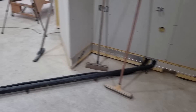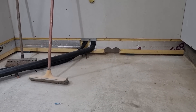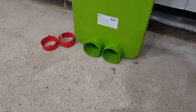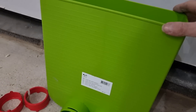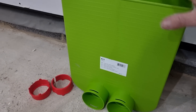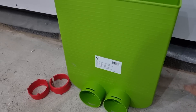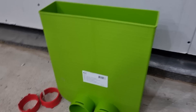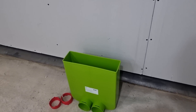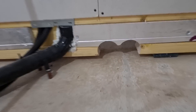While the guys get ready, I had to work out the pipe runs with them. These are the actual supply boxes that the pipes run into — we've screwed these to the floor, connect the ducts to them, and then the screeding is done. We put temporary covers over the top, the screed is done, the finish floors are put in, and then we simply cut them down to finish floor level and a nice grille goes over the top.